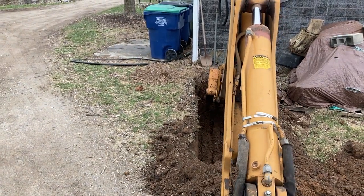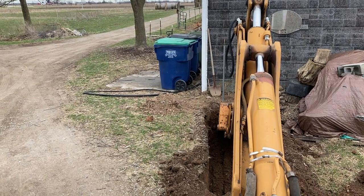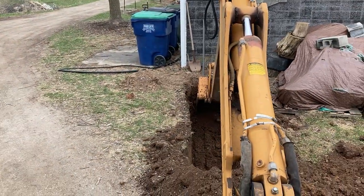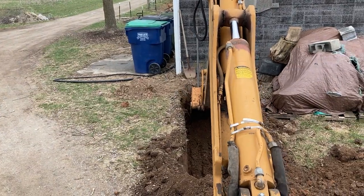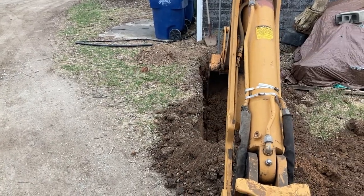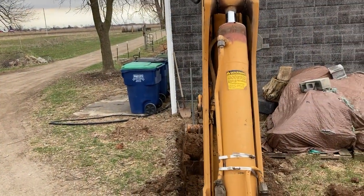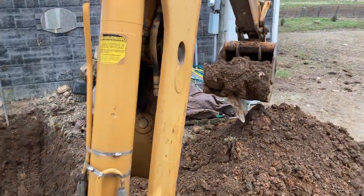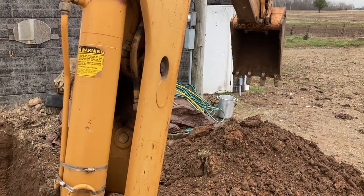You can see how I'm trying to get close to that pipe and hold it. I'm trying to hold the hammer in one hand and operate this thing with the other. So now I'm going to scoop in. I'm going to push my pads down a little more to get a little more stability here, and then you can pull it in. I'm going to give it a little more fuel. When you get a good bucket full, you raise it up, you swing it over, and then push two at once - you can dump and raise at the same time. Now how slick is that?